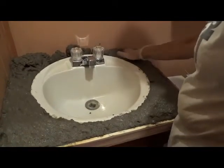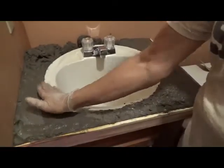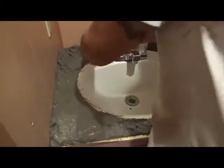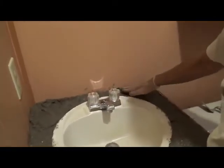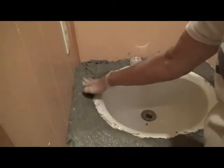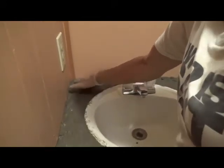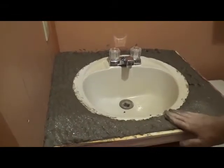I need to come up to the lip over here — when I get done I want it flush to the lip on the sink and to the lip on the outside. You'll have to take some off eventually and angle it and all that. Normally they use a vibrating machine to get air bubbles out, but what I did on the cabinets was put my air compressor on and just had it open on the bottom running against the shelf, so it shook the entire cabinetry.